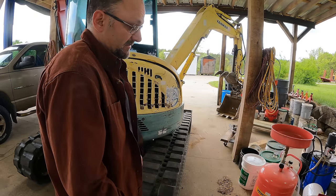I can't seal it back up without this thing. So the vacuum is still outside running. So the question is, is there anything wrong with this thing? And the other question is, am I going to be able to tell if there is? I measured it with a micrometer in multiple areas and found no discrepancy in the size. It was quite consistent. I mean, I do see marks on it, nothing that I can feel. So I looked at the whole thing under magnification, and I couldn't find anything that I would call a problem.